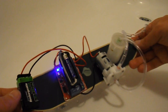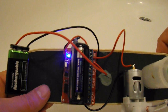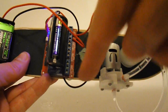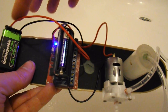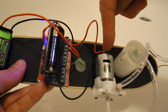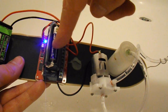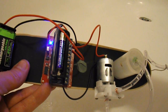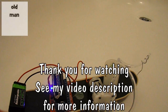Just tip that up so that you can see the way the wires go. The black wire goes all the way from the battery round straight to the motor. The red wire goes through the relay contacts and then on to the motor — so that's the power for the motor. Sitting on top of the relays there, I've got my three AAA batteries that power the electronics of the switch. And that's it — hope that helps.